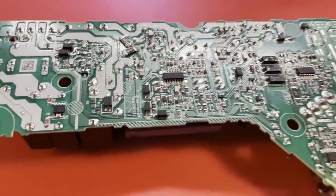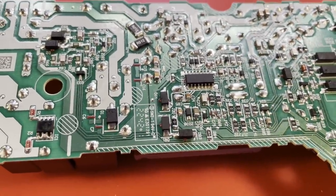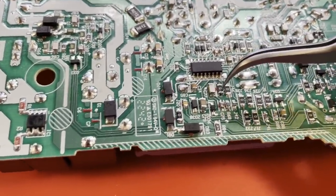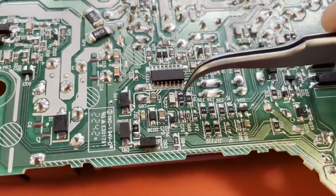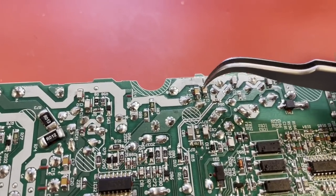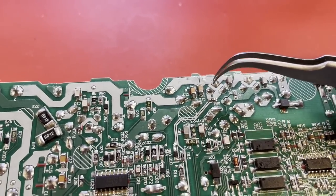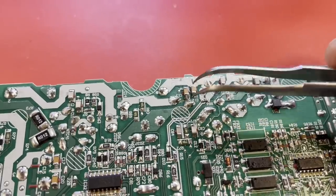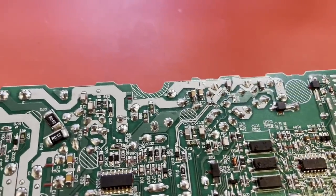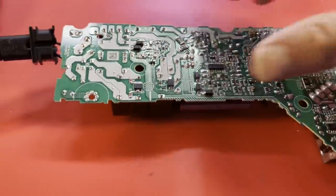All right, well, our DAP53 has been changed right here. And I reinstalled that jumper where we were isolating that part of the circuit earlier. And I went ahead and changed out both these capacitors, C12 and C13, from a donor. Those measure, I think it was 47 nanofarad. They also look like they're probably pretty high voltage. But I changed those out from the donor. And we're ready to see now if we've done any good whatsoever.